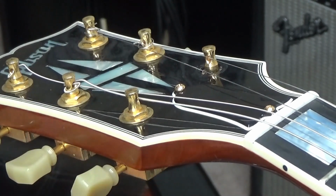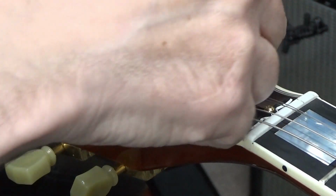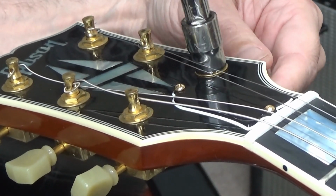But whenever doing lacquer, as a general rule, I think it's safe to say you can stop at 3000 grit and go right to the coarse compound. Or if it's a flat area, you can use the guitar buffer, the medium compound.